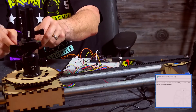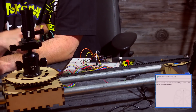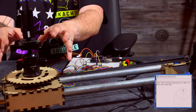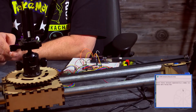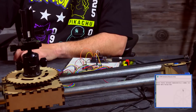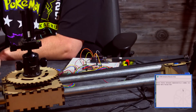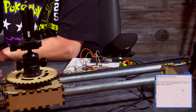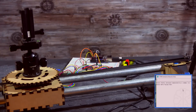Welcome back — we've just uploaded the code to the Uno and everything is powered up. I've aligned my steppers so they're facing in the direction of the starting position I want. Both steppers now have an origin of zero. You're going to see the serial monitor window at the bottom here — we're going to make some moves and see what happens. Let's start by going counterclockwise: minus 5000.